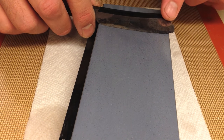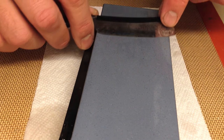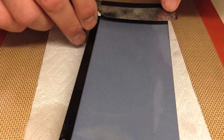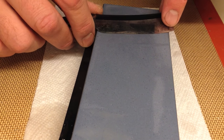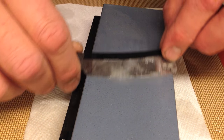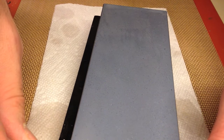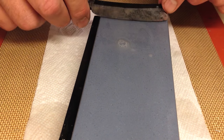I'm going to be doing a rolling stroke here, which is kind of why I have the camera facing in. Because if I just do my normal work, I'm probably not going to be cleaning up the toes so easily. You can see that there's a smile, and I really want to sort of keep that contour. It's a Shapton 1.5K 1500X, and I just put it down so it's taking on a little water, so I have to watch that. I'm going to have to stop and do some inspection with my 10X loupe.